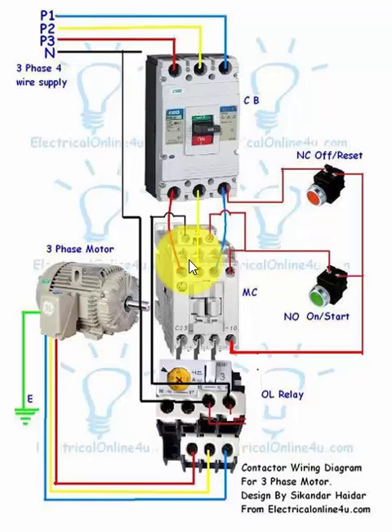It is a simple and easy wiring. When overcurrent flows to the motor, the NC contact of the thermal overload relay will make an open connection, which will de-energize the magnetic contactor and stop the motor. I also provide the earth wire to the motor and to the control box if the box is made from metal. This is simple and easy wiring. If you want this diagram, check the description below — I will provide the link to the diagram there.